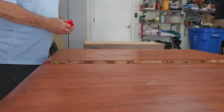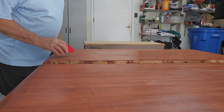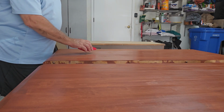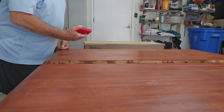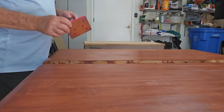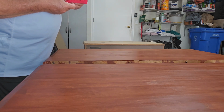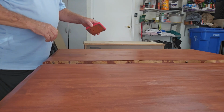I know you probably really can't see from this angle, but I've got the second coat of stain on, and looking at this, there looks like there's, I don't know, fingerprints or something that's underneath the stain. So I've already taken a couple out. I'm taking this 400 to 600 SurfPrep sanding pad. I'm just taking it by hand and kind of buffing this out.